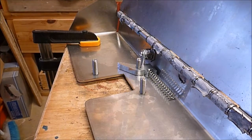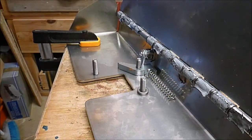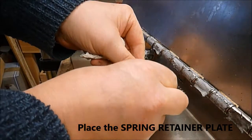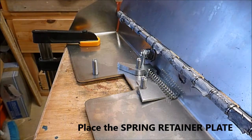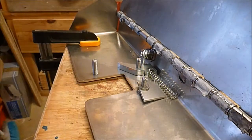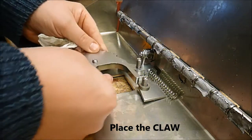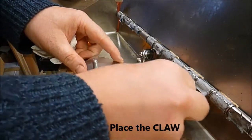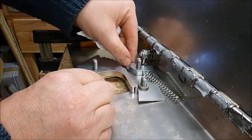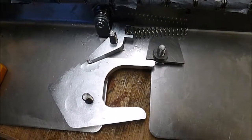This end will be held in by the top plate as it goes on. Then we put three washers onto this bolt here like that, and then we insert the spring slider plate on top of those, followed by another three washers. Then we have the ratchet plate which goes on in this direction. We want to make sure that that can actually engage with the teeth there. With the mechanism assembled it should look something like that.